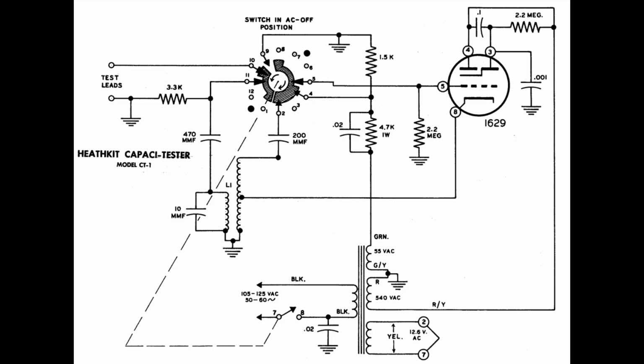And that is exactly what this inductor transformer and the capacitors are doing. That's a little oscillator, and that is of course killed, or loaded to a full stop, with the capacitor in place. And the reason for testing at a very high frequency is to test if the capacitor is disconnected, even if the value is very small. If you test it with only mains frequency, it would not be able to do that without another amplifier or some other diodes or some other much more complicated circuit. So this is just absolutely the cheapest, simplest way to do it. And I think that is such a good, genius design.